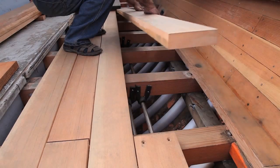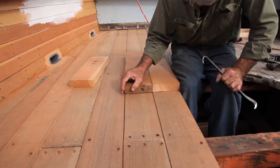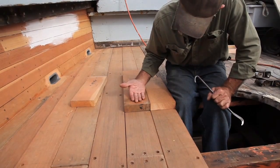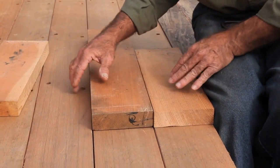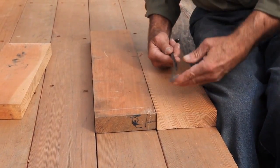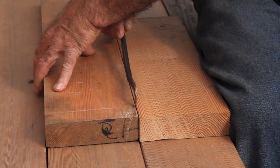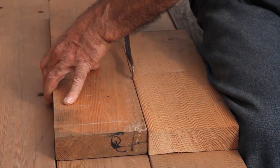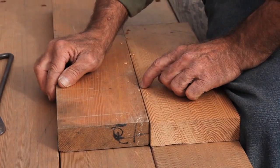You can see we've laid the deck into position on top of the deck timbers on a temporary basis — there are a few things we still need to do to it. It's a two-by-six, which ends up actually an inch and a half thick by five and a half inches, and it's quartered or edge grain Douglas fir. We placed it on the deck square edge, crowded it up as tight as we could, and then I took a reefing hook — designed for removing cotton caulking — and raked down between the boards to scoop out a little material so they were touching tightly on the back side while allowing a small space on the face side.